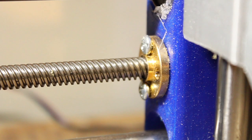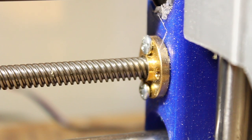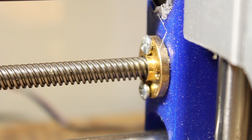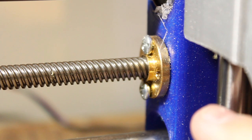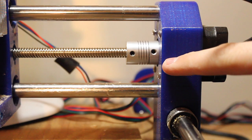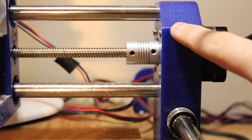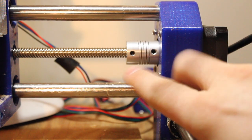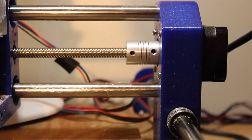One thing I'd like to improve is the screw drive — you can see there's a tiny bit of slap that can really build up. I'm not entirely sure how to get that out; maybe a different coupler. It definitely affects my x-axis movement. I'd also like to move this motor back a little bit — I've seen some designs like that. I just need some standoffs for my motor so I can have that extra inch or so of x-axis carriage movement, which would have solved the bottoming-out issue today.